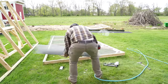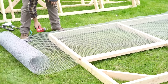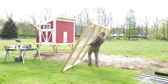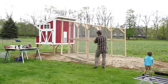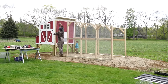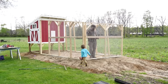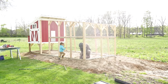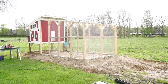I'm using four-foot-tall hardware cloth that I stretch out across the wall frames and staple to the frame using a half-inch pneumatic nailer. I trim the excess off with a handy little cutoff tool, but you can use an angle grinder or wire cutters as well. I then move the walls in place and screw them together and then to the side of the coop. I didn't secure the walls to the ground with long stakes or rebar, but I did end up adding large rocks around the perimeter later. Since it's been up we've had some pretty serious high-wind storms and it didn't move an inch, so I feel really confident the way it is.